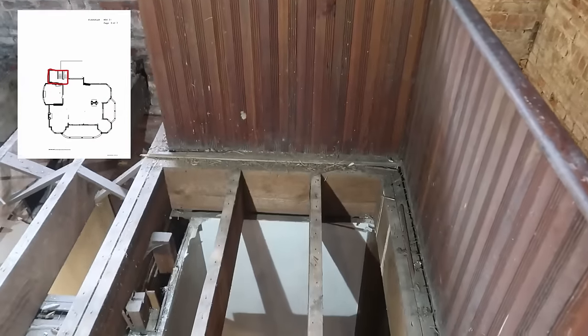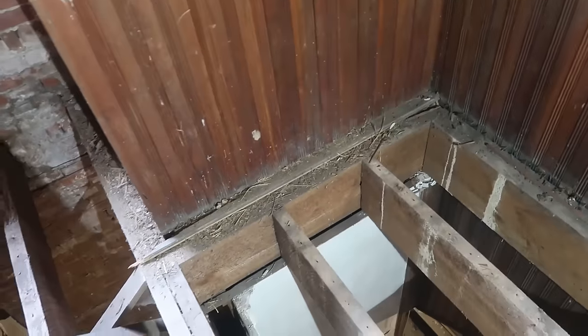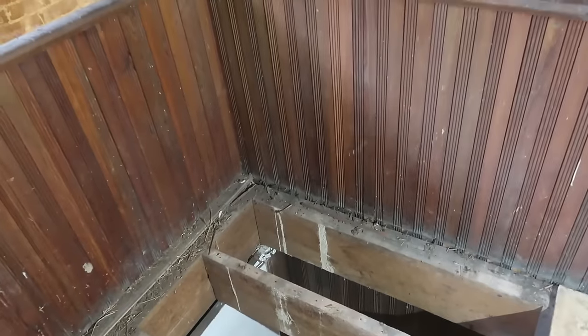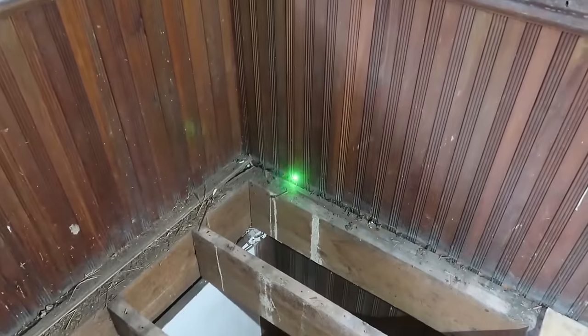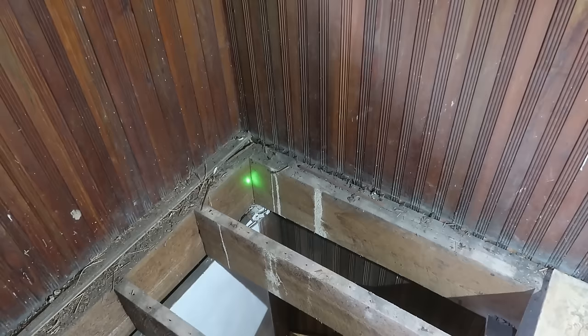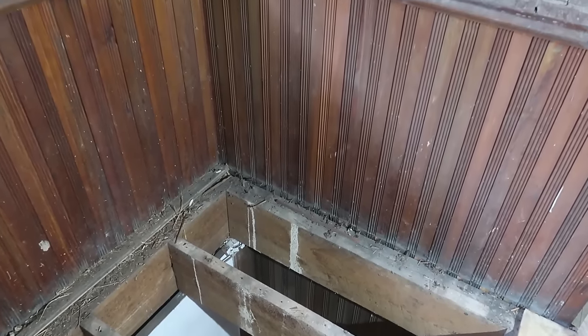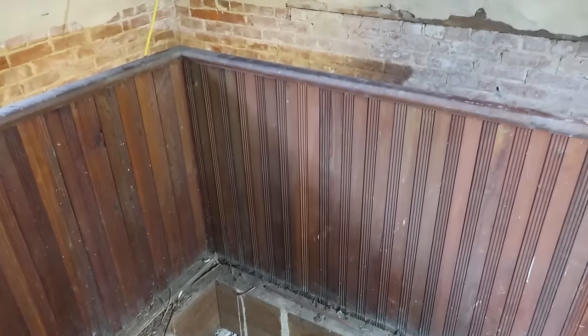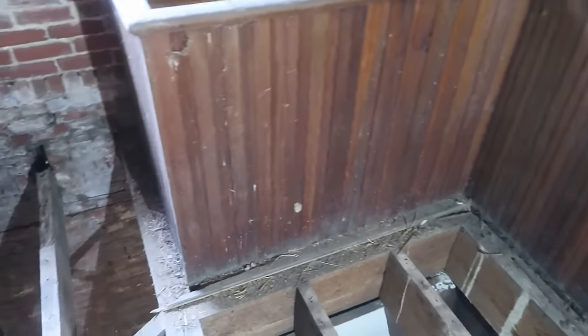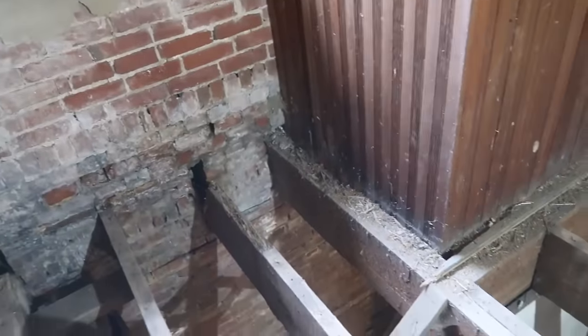All righty, this here is the top of the stairs, the attic floor. We are going to try to determine what holds this up. We want to support that better because it isn't supported very well. It sagged an inch. We know this because we used the laser level, stacked on the other side of the brick wall, so it didn't move while we were jacking.